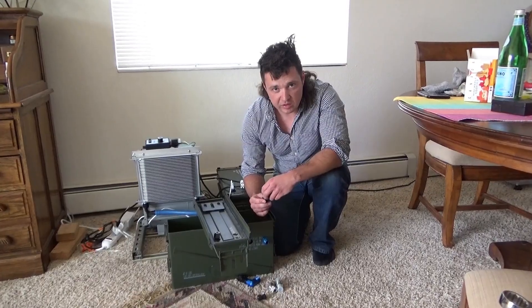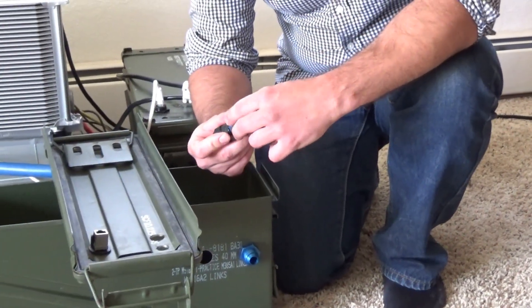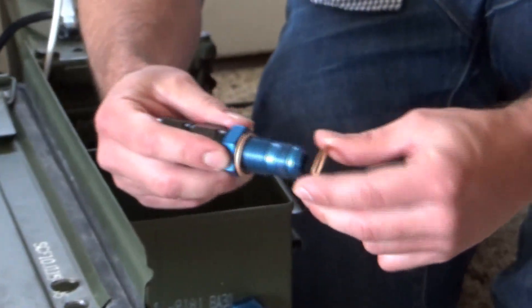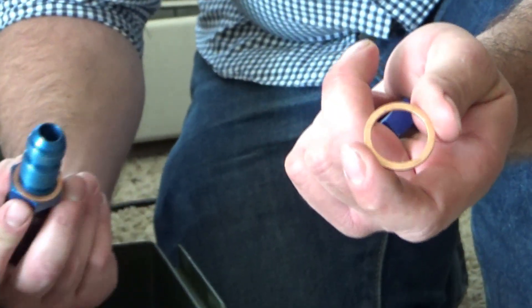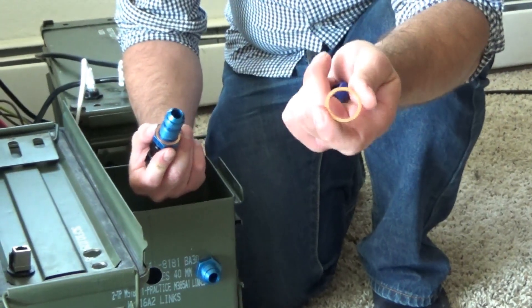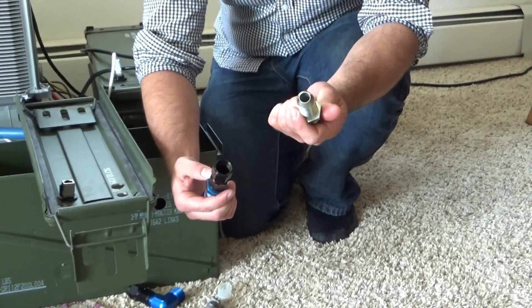I'll show you some of the design changes I would recommend on this unfinished can. In the original video, we used O-rings to seal it, but you can also use these copper crush washers — you might have seen these on cars; a lot of cars have these on their oil pans. The advantage these offer is that if you use the O-rings, this fitting is a little flexible. With the hard copper washers, it's a little more sturdy. Another option is, instead of these aluminum fittings, you can use hydraulic fittings, just like this.